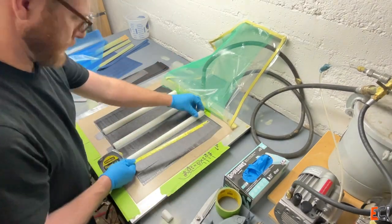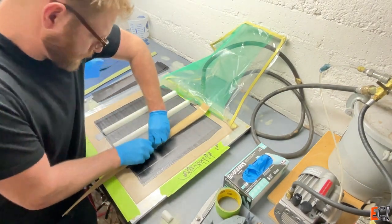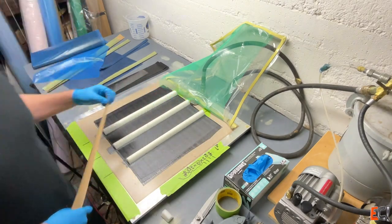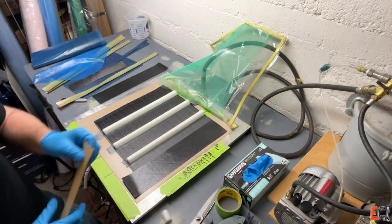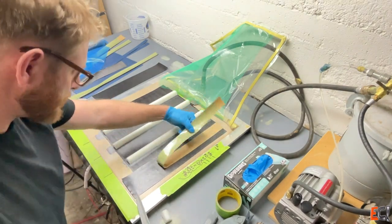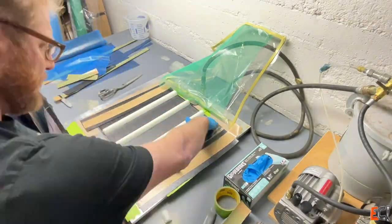And I was thinking to put the glue film on top, but it's kind of a hassle to do. It's really a lot easier to co-apply the glue film with a layer of prepreg that's going to go on top, sort of just adding the resin there. And in an ideal world, these would be vacuum bagged together, but here I'm just sticking them on there and using the heat from my hand to roughly work the air out.